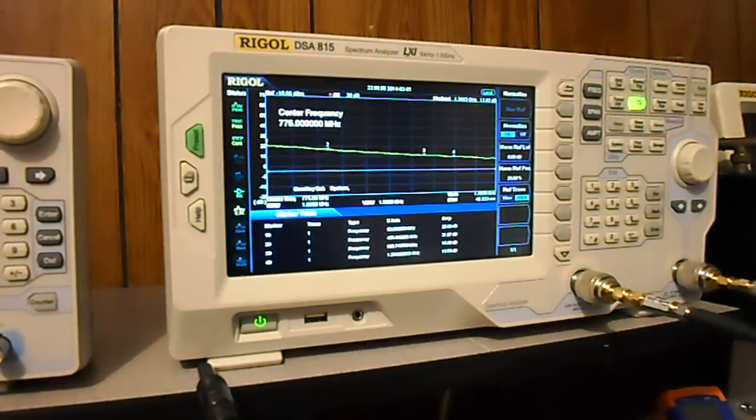A couple of these cascaded and filtered for 1296 MHz and you'd still get almost 30 dB of gain with good weak signal amplification. You'd have to switch them out, but they're pretty good. They're moderately priced too — I believe between $49 and $69.